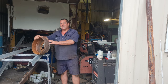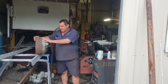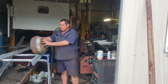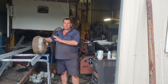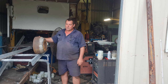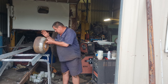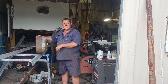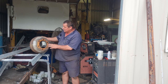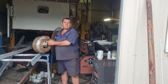I did have a talk with the guy and I did tell him that when you're machining these sorts of things, you've got to leave these drums bolted to the hub. The reason being, when you re-bolt these back up it actually warps the drum — so they've all got to be assembled and then you machine them. Something got lost in the translation and he pulled them all apart and sent the drums down by themselves. This has been going on since last year actually. Anyway, I have the hubs there. The plan is I'm just going to buff this face up here because that's a datum, a reference edge for setting it up in the lathe, then reassemble the hubs onto it and we'll look at putting it in the lathe and taking a skim.